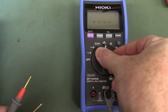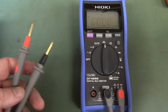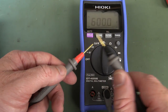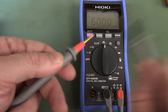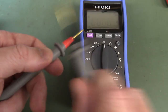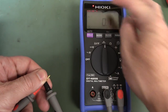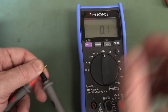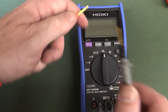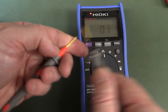I really like that it's got a separate continuity switch position — no touching buttons or any rubbish like that. Let's see how quick it is. That is latching and instant — that's one of the best there is. It's also got a visual alert. Why can't they latch that? As soon as it buzzes, they should latch that rather than have it continuously on. They've gone to the effort to do that, but they haven't gilded the lily.